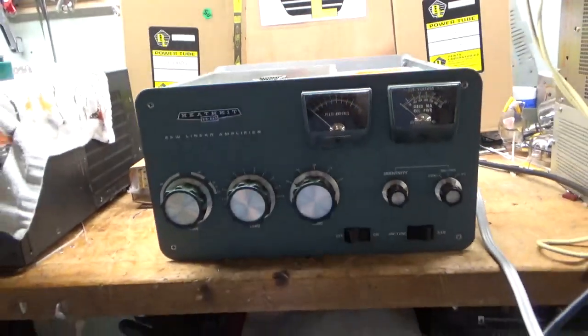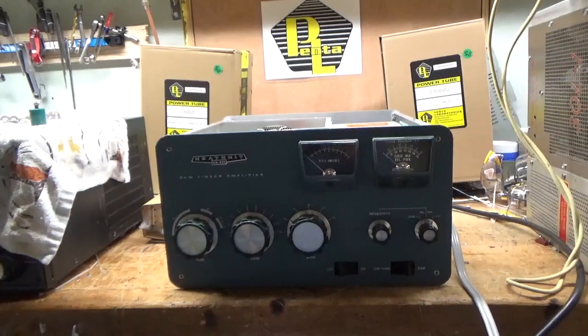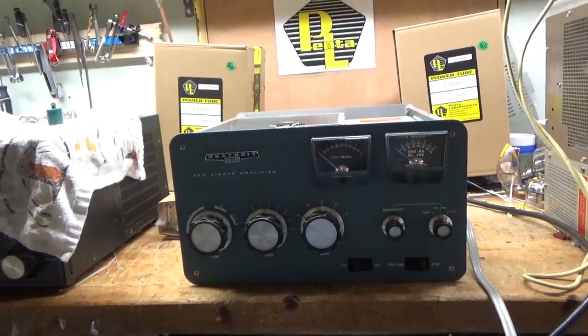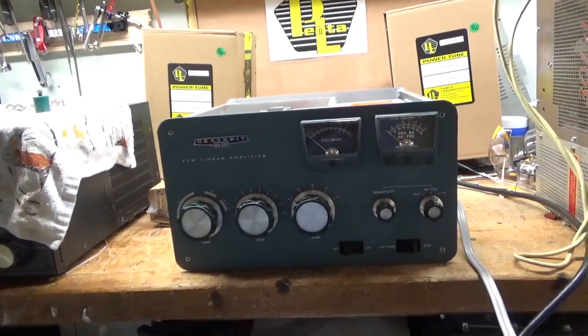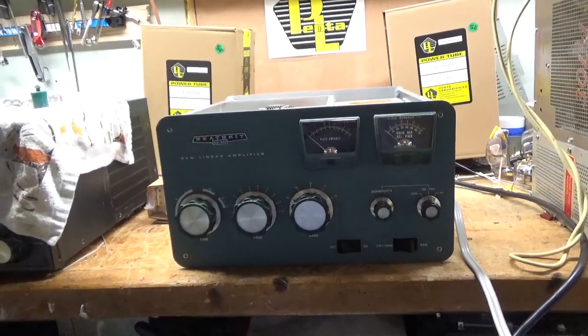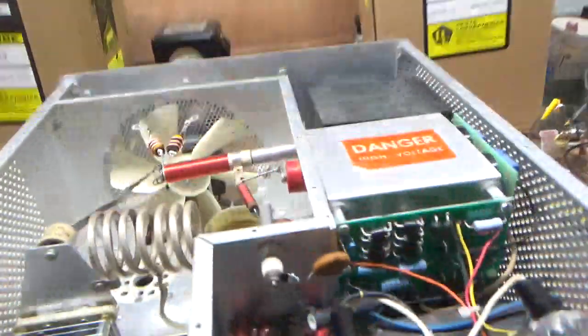Please don't do it. You may not even notice damage that's occurred from being tested at levels above what it's supposed to do, but just don't do it. To gain 3 dB, you have to double your output. So 1200 to 2400 watts is one half of an S unit — just not worth it. Going a little more than 1200, the other person's not going to notice anything. It's not worth damaging the amplifier.